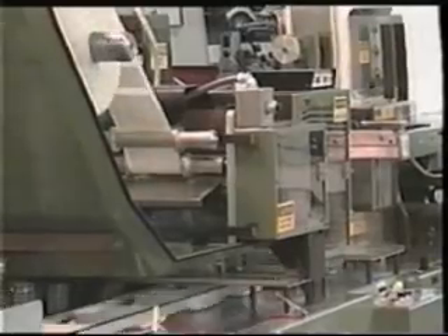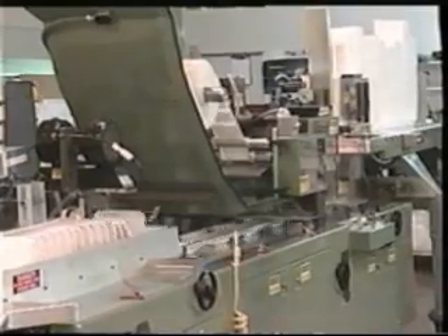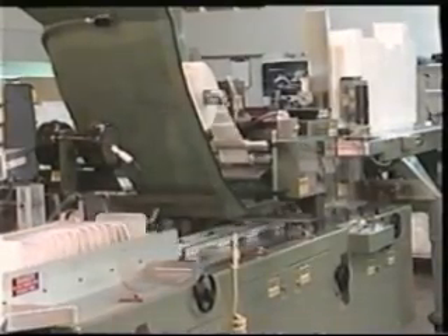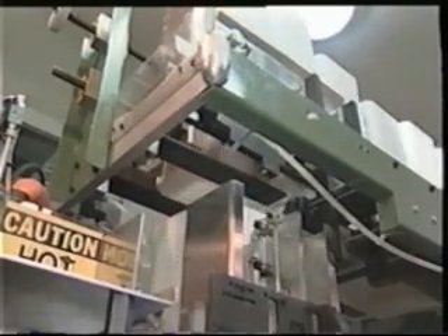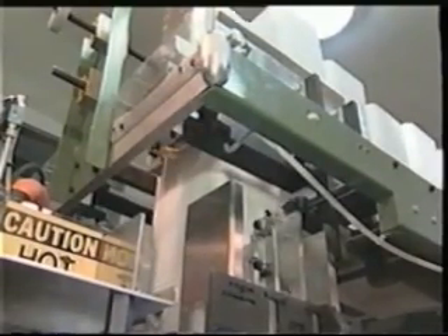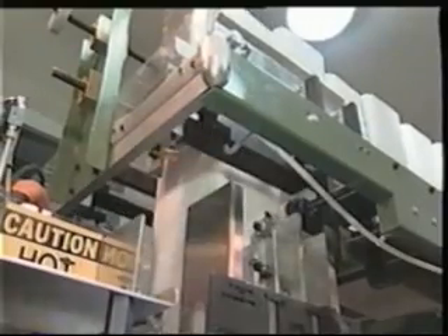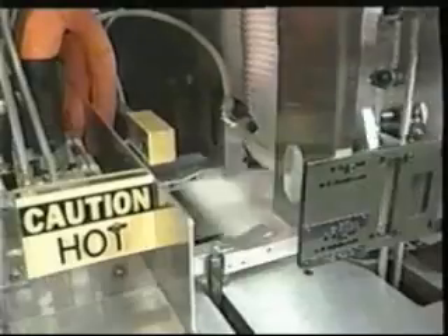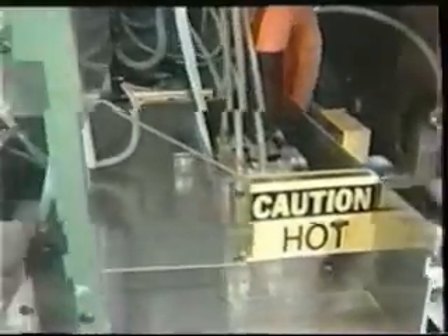The tray apparatus you see under the roll being paid out is a double-walled sheet metal pan that has perforations on the top to collect dust. The air is drawn through these perforations and through a bag-type filter system that collects dust. The pouch-type pad does not give off much dust when it's being unrolled or cut; however, the ply-type material does. At the denester, a lot of dust is generated from angel hair and particles on the trays. At the point where the tray strikes the deck, we are drawing air through the filter system to collect the dust in this area also. The pad cut-off area also has dust collector tubes so that the dust emitted to the plant is kept at a minimum.